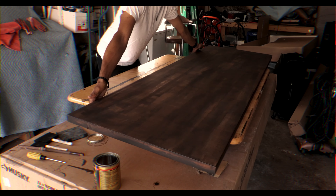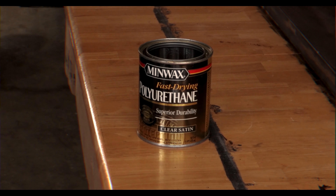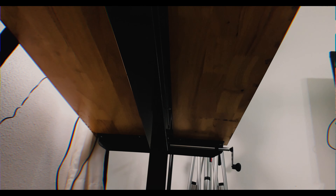The next day I applied the stain again, and this time it actually worked. The stain soaked up much faster — last time it took hours and days; this time only a couple of hours. After it dried, I applied another coat and let that sit. The next day I added a clear coat for a protective finish so cameras or dishes wouldn't scratch it. I also picked up a wood stain marker from my local hardware store to reach the Husky logo and corners I'd missed. We didn't bother touching the bottom since nobody sees it.